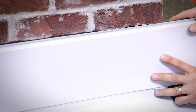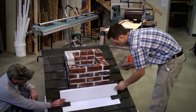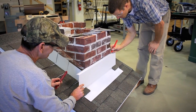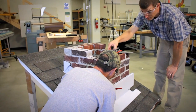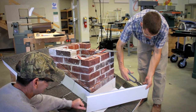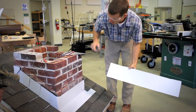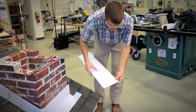To start off, we're going to center this on the joint — I should have somewhere around three inches, which I do — and just make a mark. I want the bottom long, but this top leg I need to snip off, so I'm going to make a mark right where I need to snip off that top leg. Then I'll snip through the open hem in one snip and the tab that remains will be cut off on both ends.